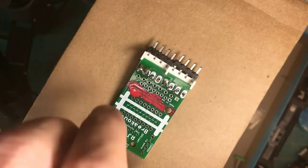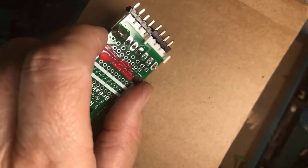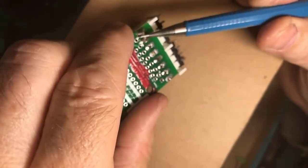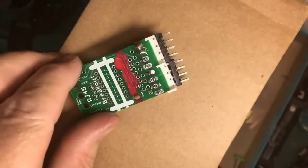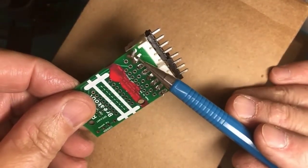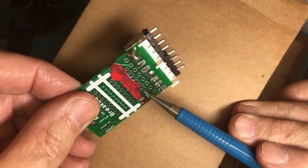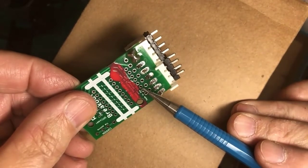Now, on the subject of not being able to see it, there's another issue. You notice how hard it is to see the solder bridge here because there's a lot of flux sitting here. Come on now, focus on the piece. There's a lot of flux here, and this flux obscures the state of the thing that you're soldering. So flux removal can be an important quality step for post-inspection of your work.